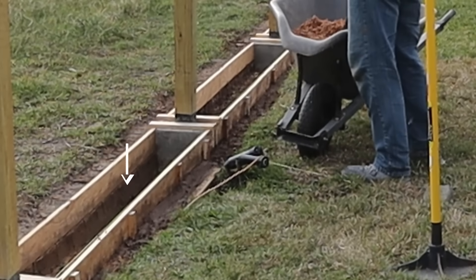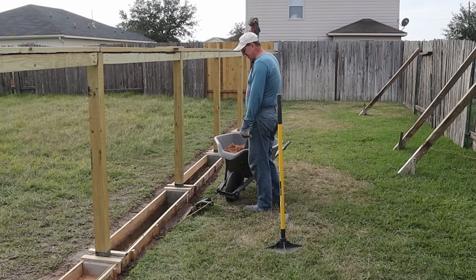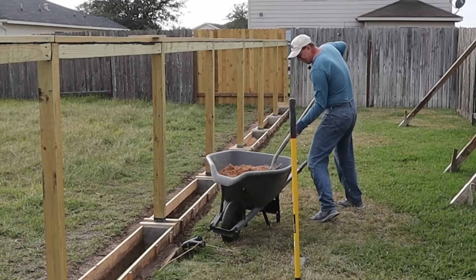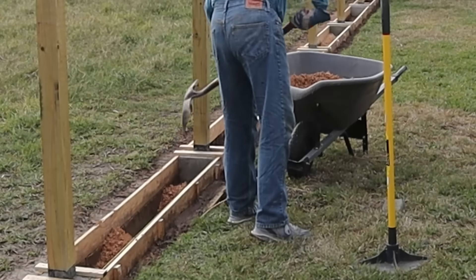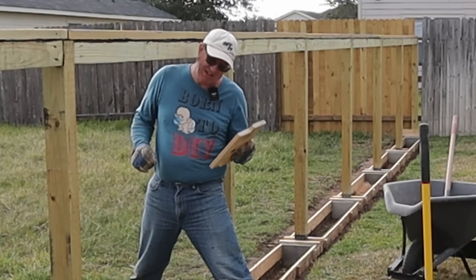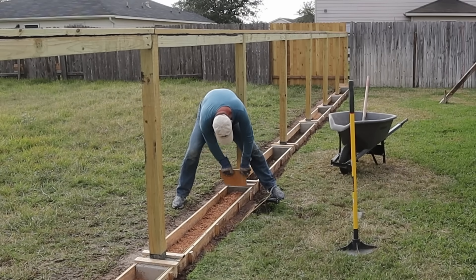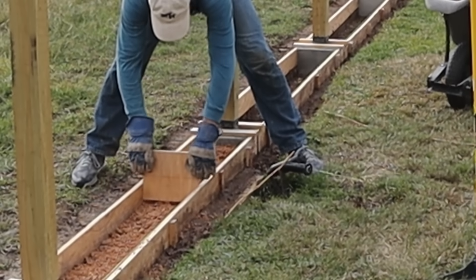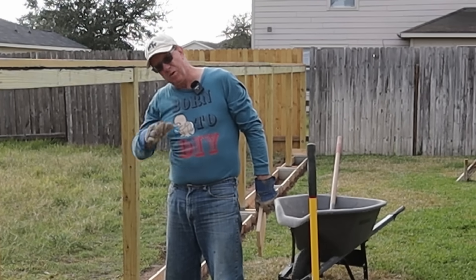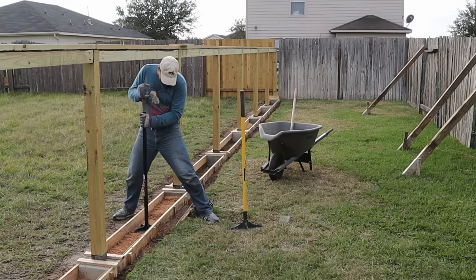Now it's time to put in some limestone packing. Some of these holes are pretty deep — I originally was going to fill some with mud, but it's just too much work, so I'm going to fill all of it with limestone pack. I've got a board cut to nine and a half inches wide so it fits inside, and the depth is going to be three and seven-eighths. I take and screen it at an angle — it doesn't matter if it's more than four inches because I'll pack it, then run the board straight across and get my three-and-seven-eighths. I'm going that extra eighth inch to have the packing above the form so I don't have any worry about concrete bleeding under.